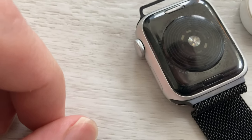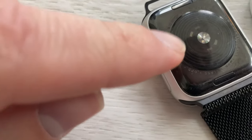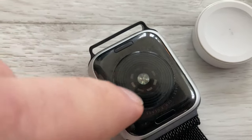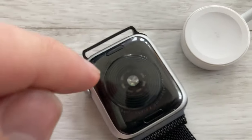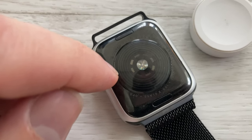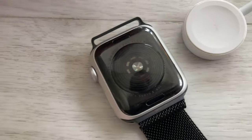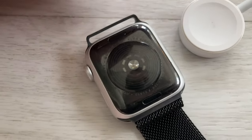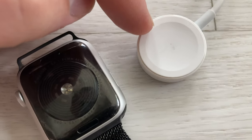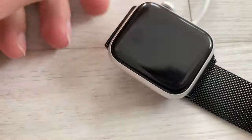They used Ion X glass, and it is a ceramic case back. Inside this ring here is an electromagnetic induction coil linked to the charging circuit for the battery and circuit board here, and a corresponding coil inside the head of the charging adapter here. When these two bond like that,